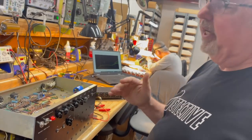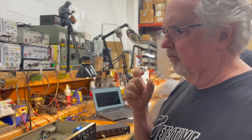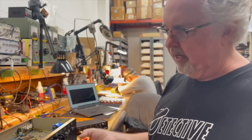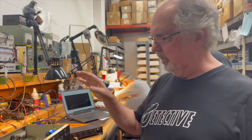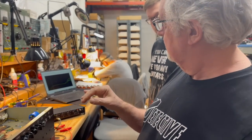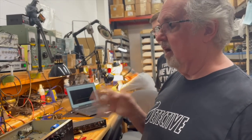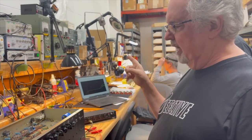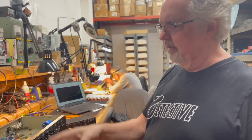My operating theory at the time was that the frequency compensation network on the earlier amp is responsible for the extra brightness and tubbiness of the sound of that amp relative to this one. Makes sense. So what we did was we analyzed that compensation circuit's performance and took a snapshot of it. That's really the main difference, circuit wise, between the two models. And I postulated that was causing some exaggerated brightness and depth.